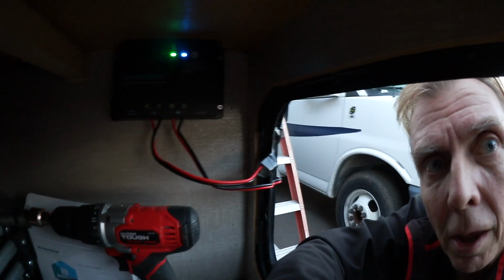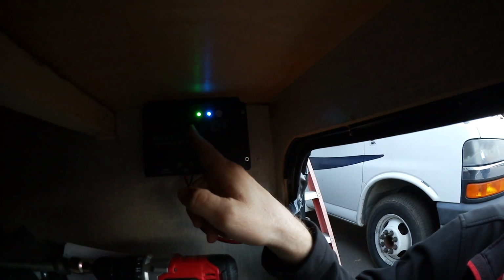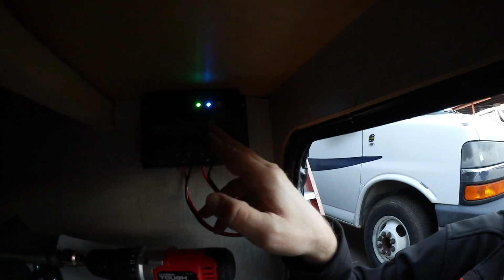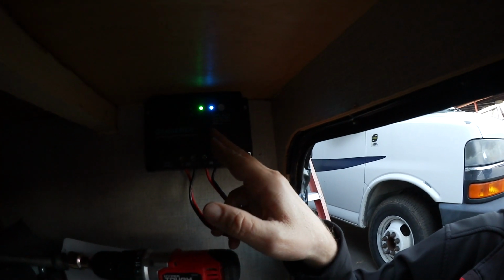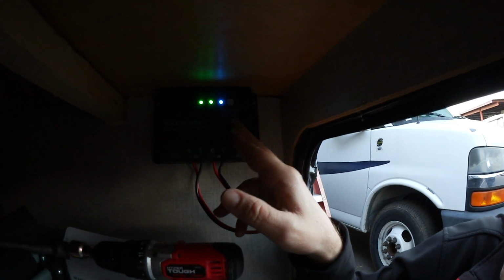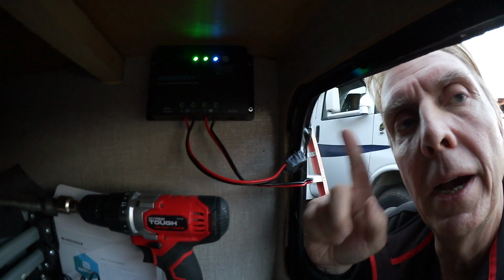and this is a charge controller from Wanderer where you can change it. You see the PV is flashing, and then you can change that to lithium battery, lithium-ion battery. And it's very slowly charging right now. There is green for sealed, gel batteries, flooded batteries, and lithium-ion. And I have a lithium-ion battery. I can show you that as well.